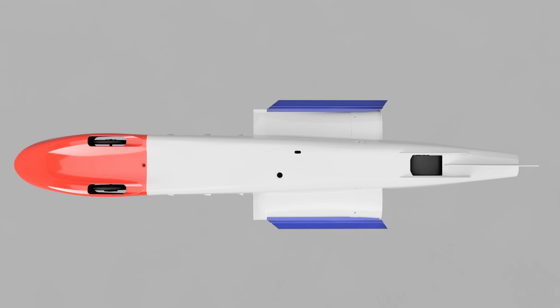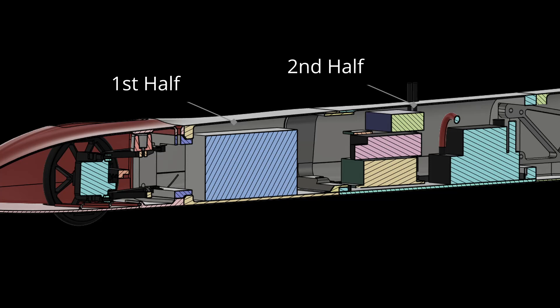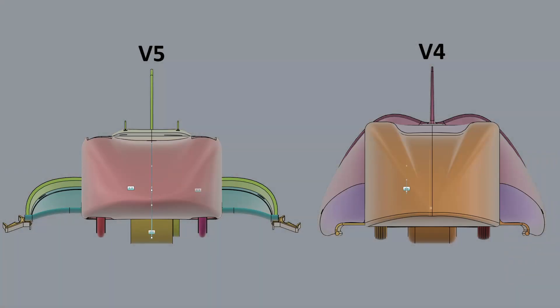This is version five of the Streamliner. It allowed me to improve the weight distribution of the car so that I can have more weight towards the nose for stability. The middle monocoque is in two pieces with a bulkhead similar to how I connected the two halves of the RC hypercar, bonded in with some CA glue. The car is about 100 millimeters longer than version four. I changed the design philosophy from a tall and narrow body to a shorter and wider body, ending up with actually a little bit less frontal area.